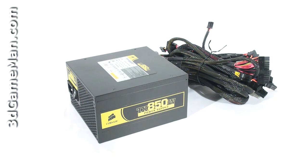Also, some might be interested to know the peak amps on each rail. Well, the 3.3 volt and the 5 volt rails are both 30 amps each, and there's a single plus 12 volt rail, and that's 70 amps.